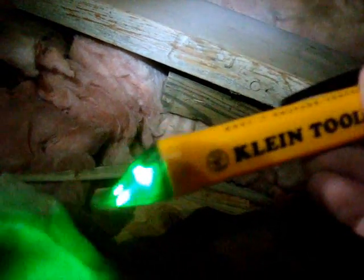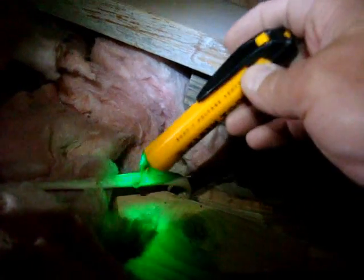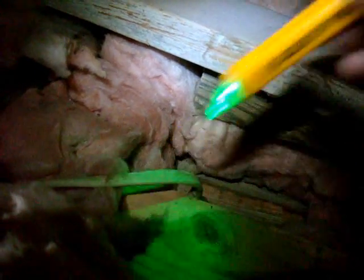So I'm going to put this in today. This is the wire where the ceiling fan is mounted — it's one of the original wires to the modular house. The very first thing I'm going to do is use my inductive tester to make sure that it is in fact off. The green light tells me that there is no power there.